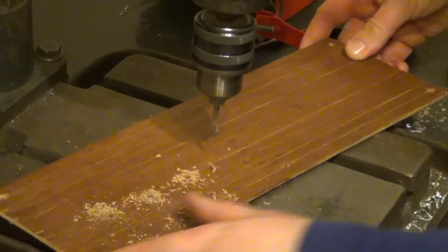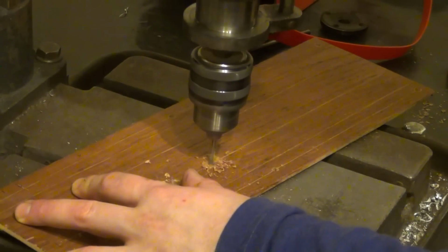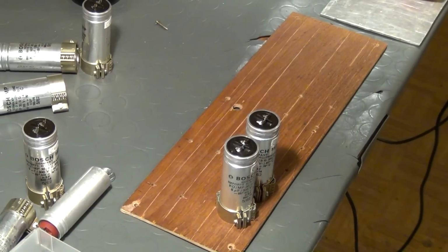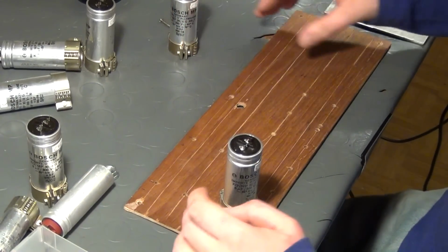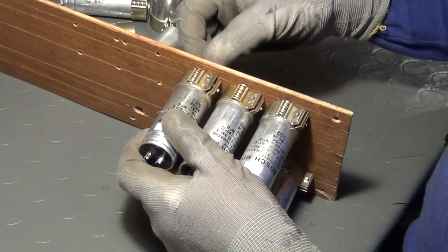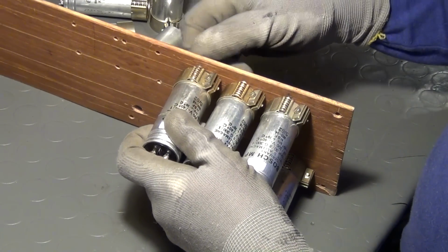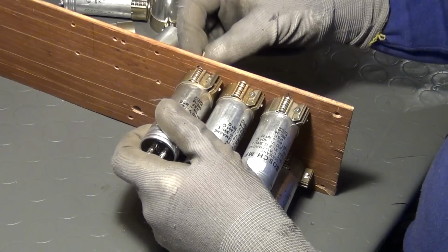which also needs some mounting holes in order to bolt the capacitors to the plate. I choose wood rather than aluminium because I want to insulate this entire module from the rest of the device. I don't want to provide a conductive path between 2 points of large potential difference via the metal cans as I would when metal would be used as a base material.